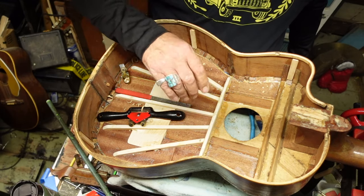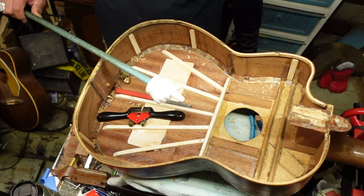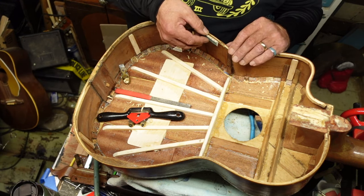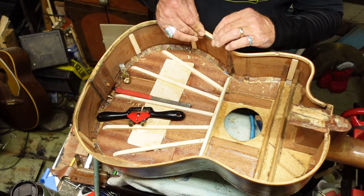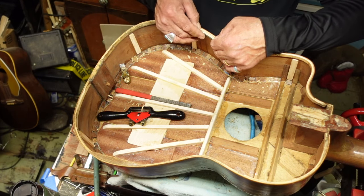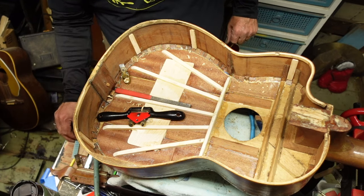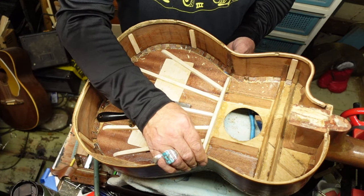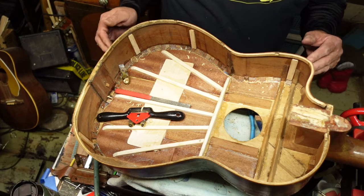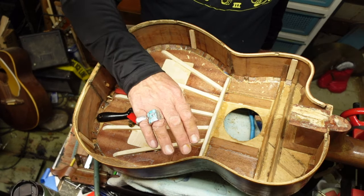So we're going to carve out and lay braces like this one right here, but upside down going across the back. And then when we put in our kerfing, you're going to see wherever the brace goes, there will be a gap in the brace. But that's going to give us glue surface. It's actually going to almost triple our glue surface. So get this smooth, get the kerfing in everywhere, and then it'll be time to start pulling this in and get everything just right, because I think we've done a lot of work that you saw already to keep everything stable. There's going to be a couple more cracks, and then we're going to figure out how to amplify this thing. But that is what we're going to do to get the back on.